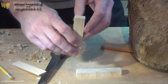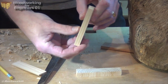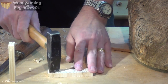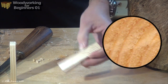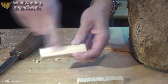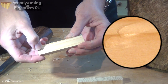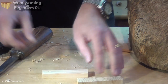What does the grain have to do vertically in a tree? It has to resist wind loads, so it resists breaking if we try to bend it. Now let me demonstrate those properties. This is end grain — here's a hammer. I've hit it and there's virtually no mark there; it takes that pressure without any problem. This piece of long grain — remember the grain going in this direction — if I hit it, you can see the surface is ruptured and there are big dents in it. So it's not as good at taking a load on the long grain as it is on the end grain.